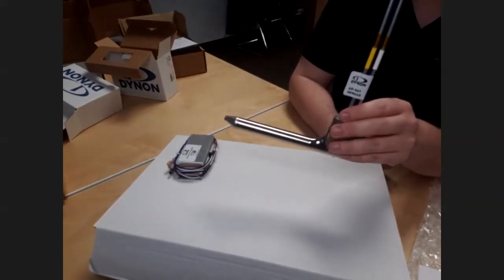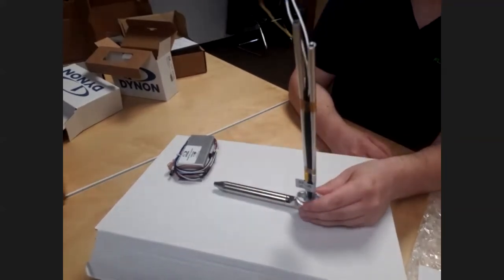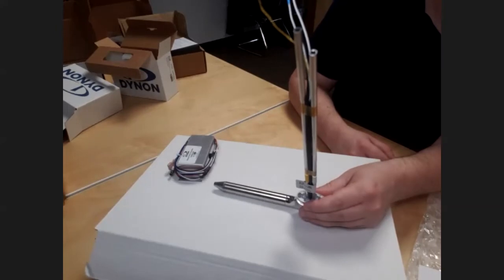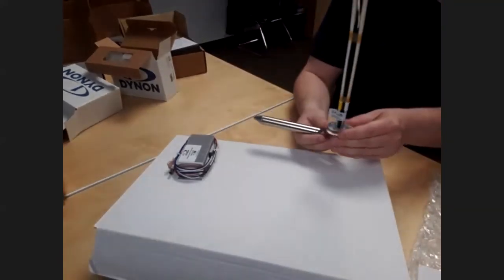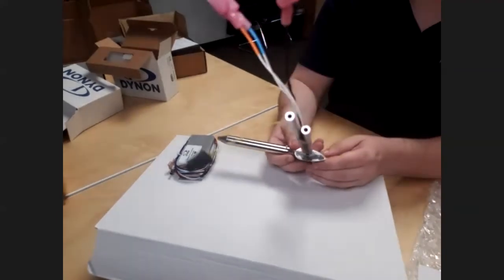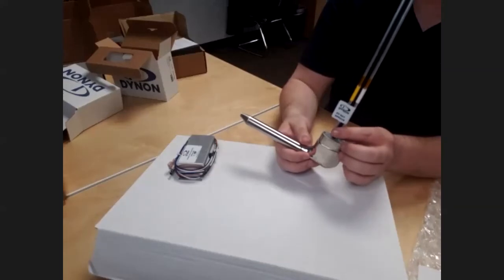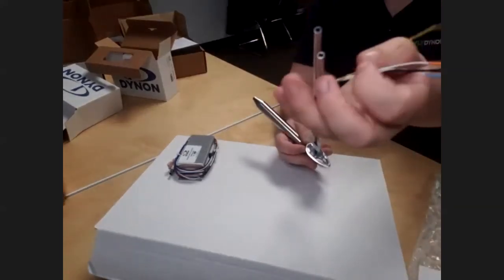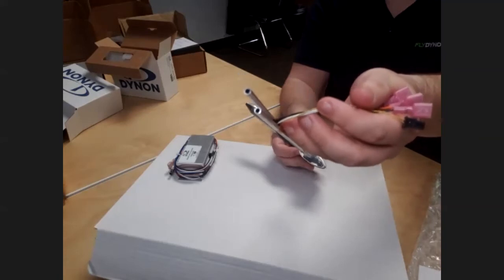The bracket is the standard AN5812 size, which is really common. We also have a pre-manufactured bracket that's designed for use with RVs, and people adapt it for other airplanes as well, but it's really meant for RVs. Those two pneumatic ports are, of course, pitot and angle of attack. Sometimes people will mistake that for pitot and static, and it's not.